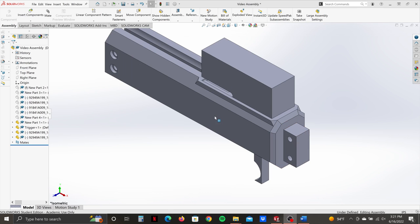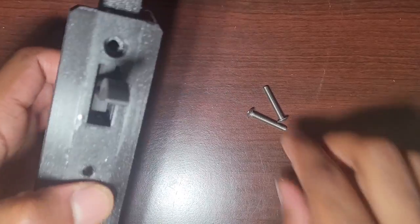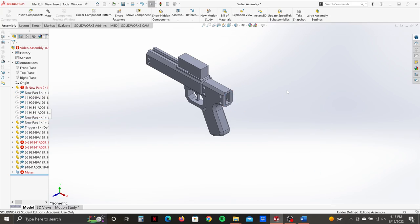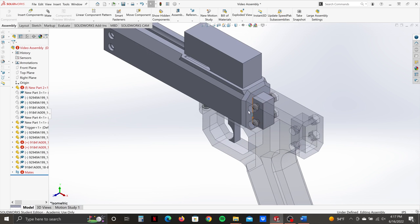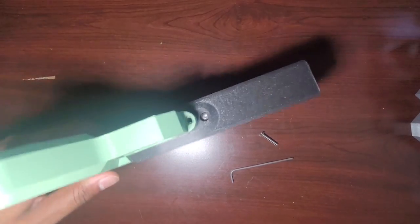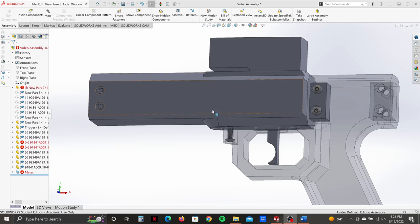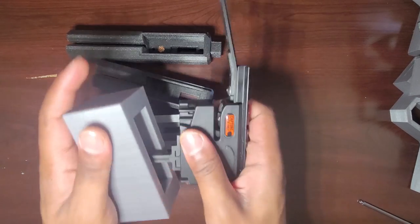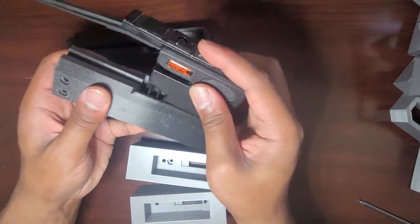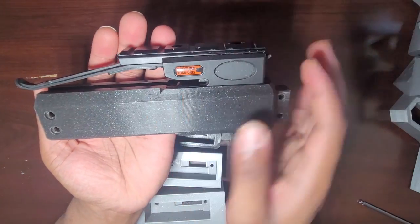The trigger mechanism is assembled to its housing using two machine screws that will mate with the internal threading of the trigger mechanism. You must secure the trigger mechanism to the housing with these screws before attaching the housing to the grip. The trigger housing is assembled to the grip using the method mentioned earlier, but there is a third screw at the tip of the trigger guard that mates with the internal nut placed in the trigger housing socket. It took several tries to get the trigger mechanism perfectly flush with the top of the housing — it was crucial that it be flush in line with the flight groove, or else the serving wouldn't properly catch an arrow.